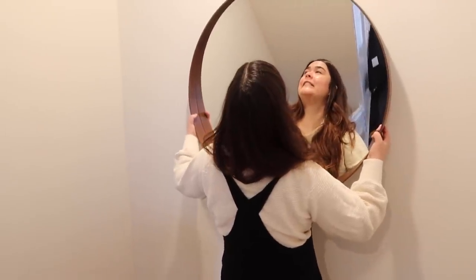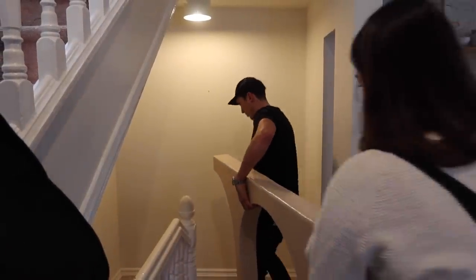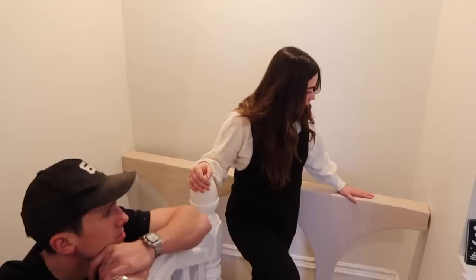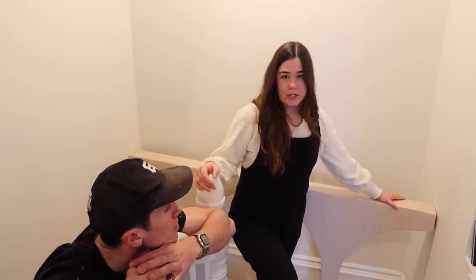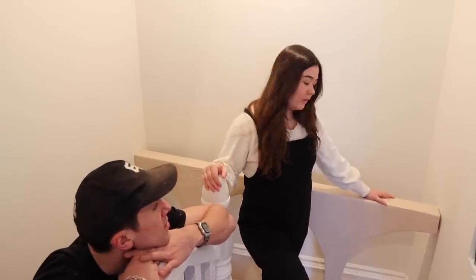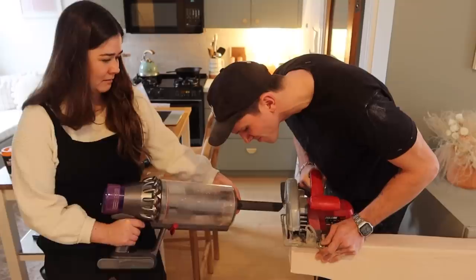It's the next day, the paint has dried, and Graham brought the console over — I'm so excited to see how it looks. I'm taking down the current mirror and replacing it with the one from the bathroom. We're bringing the console in — oh, it's a little tight. It doesn't fit because plastering added a little bit on each side. If you're doing this project and want it to go wall to wall, go a tiny bit less than exact measurements. We're going to cut it down with a saw, though you don't really want to do that because the plaster could crack.